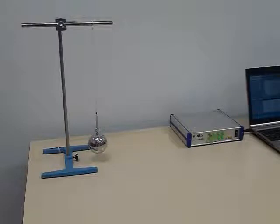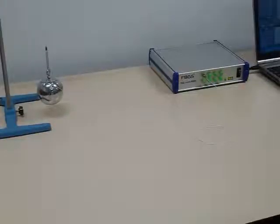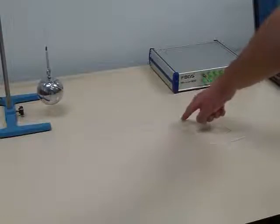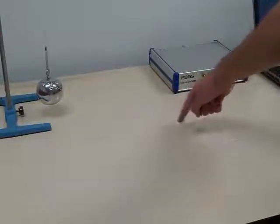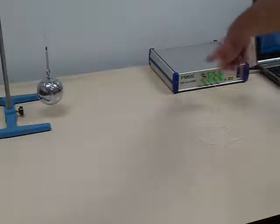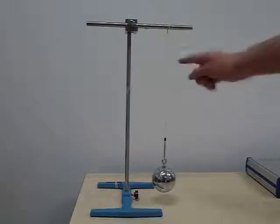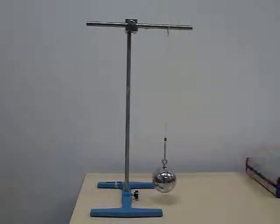In this demonstration, we hang a 700g steel ball from the draw tower fibre via a spring. Draw tower fibre has been used between the spring and the splice here, while ordinary telecom fibre has been used from this point to the interrogator. In this small section, there are 15 closely spaced gratings written into the fibre, and they all have different wavelengths so that they can each be uniquely identified.